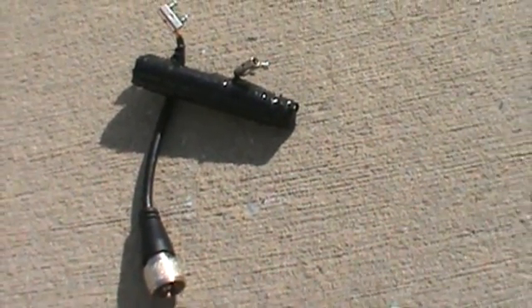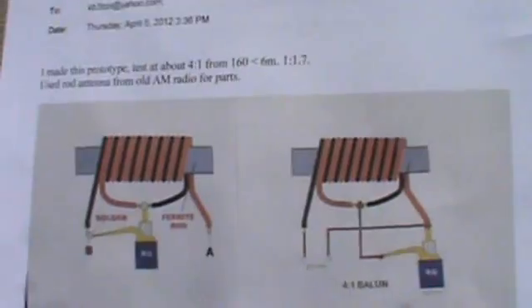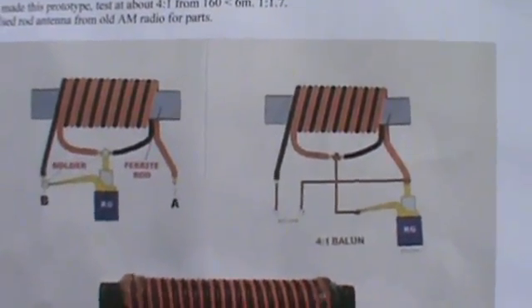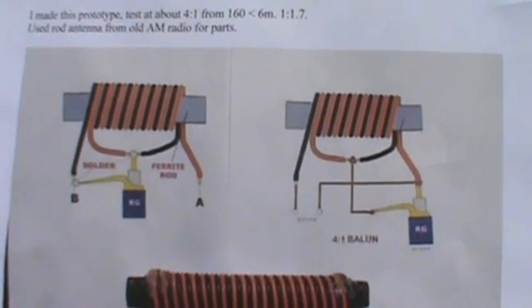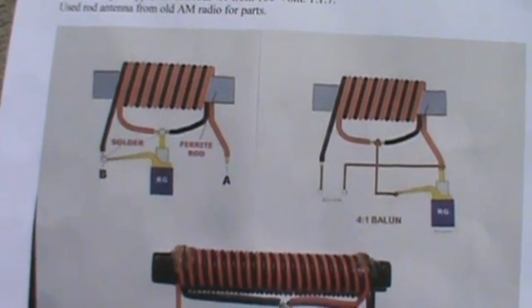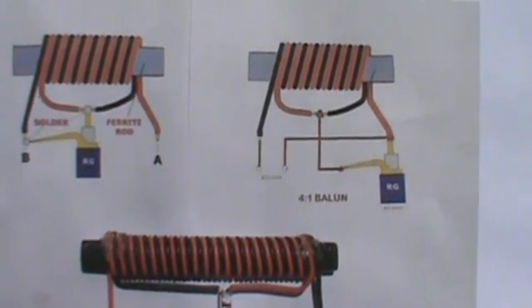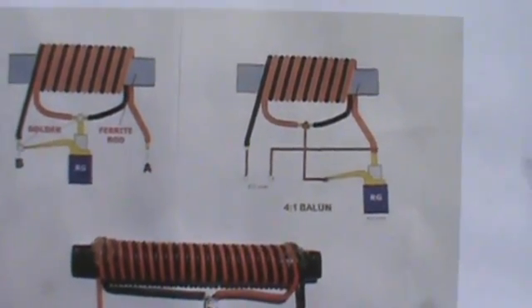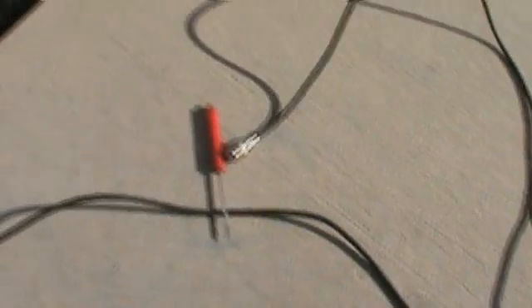We made a 6 meter delta loop antenna and that works just fine. So I decided I wanted to make other delta loop antennas. I started out with a 2 meter antenna — I think it was 7 foot 5 and 3 quarter inches. I couldn't get the SWR lower than about 1.7 to 1, which is usable. However, I decided to keep going and ended up building a 70 centimeter version.